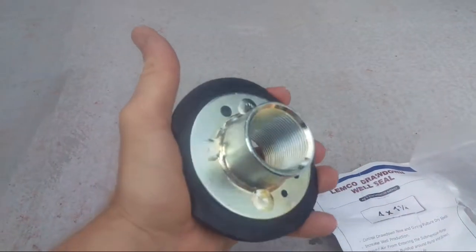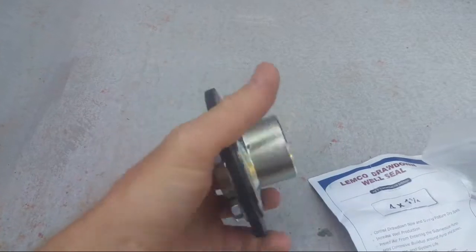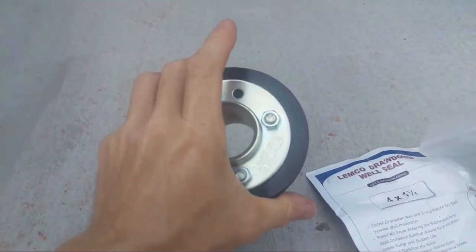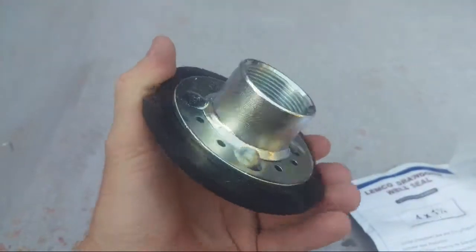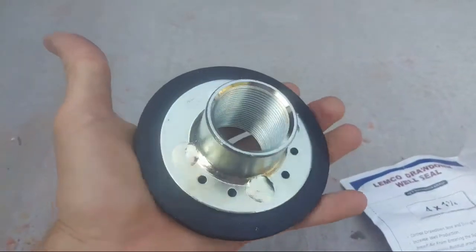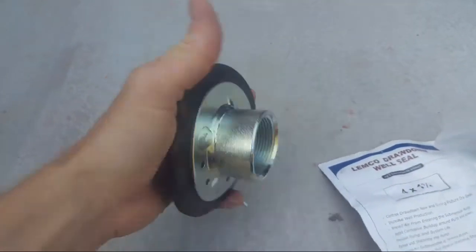I mean, it'll bend. I don't know. I've never dealt with pitless adapters because we don't have any 5-inch wells. Prone to freezing down here. But yeah, I'd say you've got at least a 1/2 inch of play if you were to try to push it past between both sides.